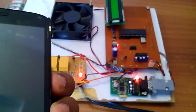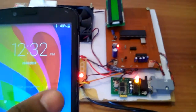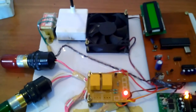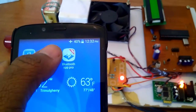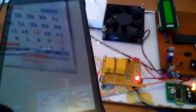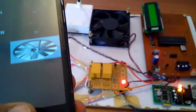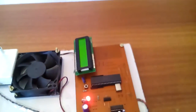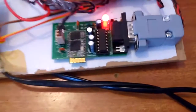We developed an app that will turn on the Bluetooth module. First we give power to the Bluetooth module and the relay coil. To operate, go to Settings, then Bluetooth, scan, and it will show the HC05 device. You need to pair both devices — the password is 1234. After pairing is done, we go to the output part.